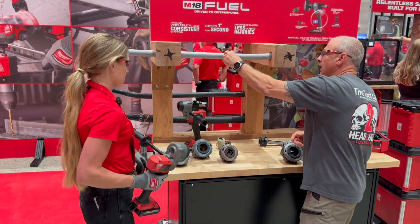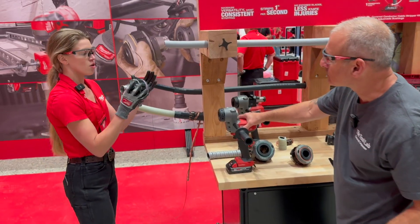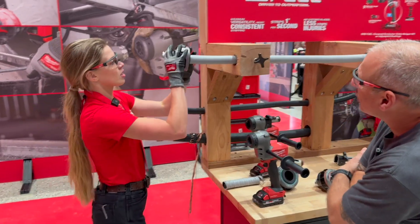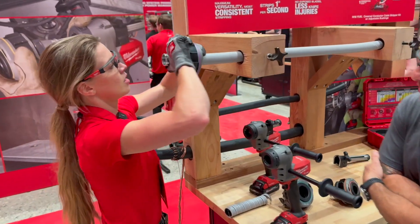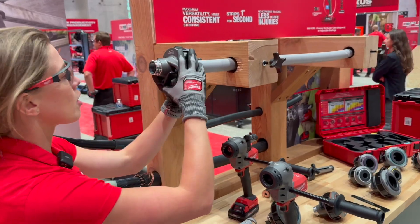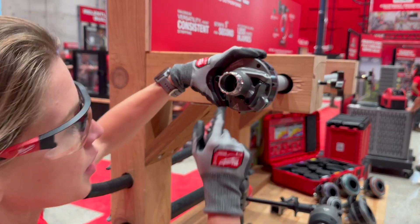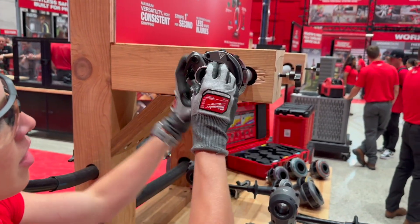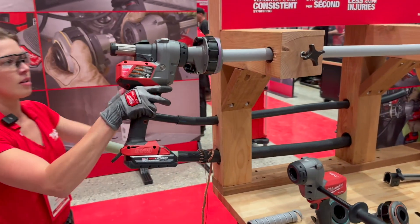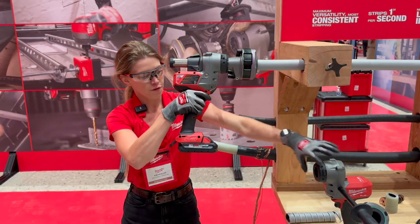So this one here would be purple. We'll put a purple head on. You first want to set your bushing to the material. You set your outer diameter, unlock this lever, and clamp it around the material you want to strip. Your second adjustment is your blade setting, which accounts for the thickness of the material. You want to set it a sixteenth of an inch away from the highest conductor strand on the internal conductor. Then it's a quick connect to the tool — it snaps in spring-loaded. Two-finger release.